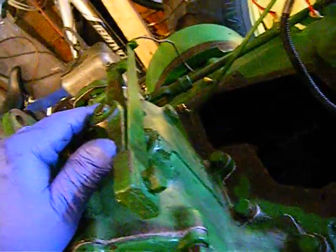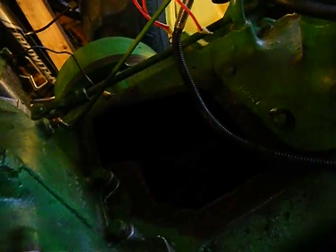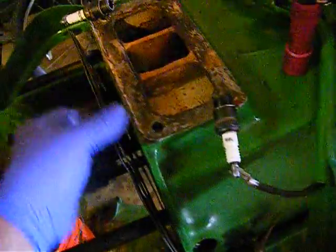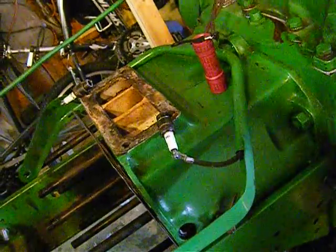Next, probably what I'm going to do is work on the carburetor, because I got that box and I'm pretty sure that's my float valve for my carburetor. Then I need to get some torque values on connecting rods, because I don't have those torqued down yet, and cylinder head nuts. I think I have my gasket on backwards — I think the metal side is supposed to face the head, I'll have to check online. While I'm checking online I'll get torque values, valve clearance which I think is 20, torque values for the head, torque values for the rods. We're in good shape, we're coming together.